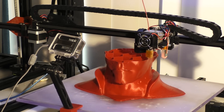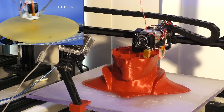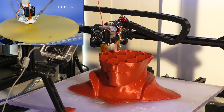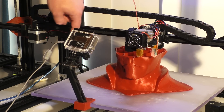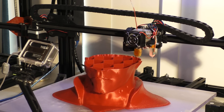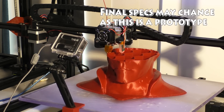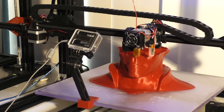Another really cool feature is it's implemented the new BL Touch sensor. That's an auto-level probe for the bed, because Lexan is not going to be as flat as glass. I've set this up to do 25 probe points across the bed — 5x5 — which produces a digital map of the bed flatness and compensates by adjusting the Z-axis to ensure a perfectly level first layer and continual level print.